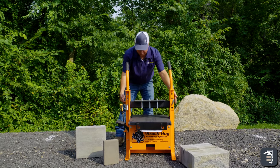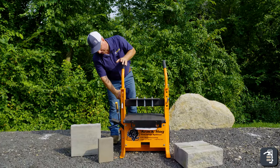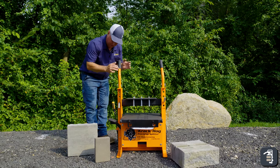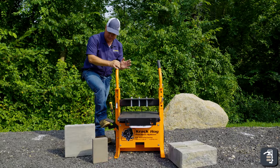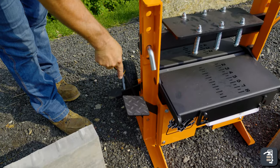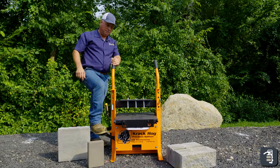Simple adjustment with the two-pin system — you pull the two pins and can adjust your arm up for the initial adjustment; the heights are built right into the side. Once your product is in place, hold it nice and level. There's an inching pedal that moves the blade straight up and brings it tight to your product, kind of locking it in. Then you tighten up the hydraulics using the release-and-tighten control.